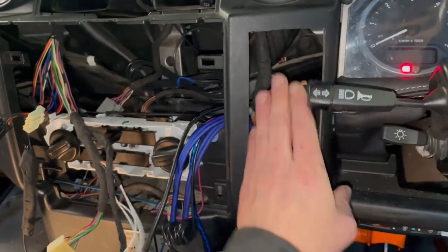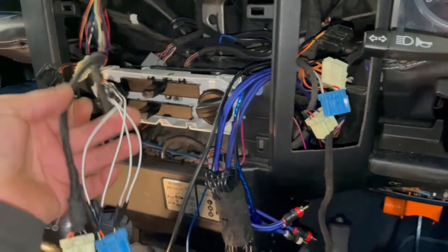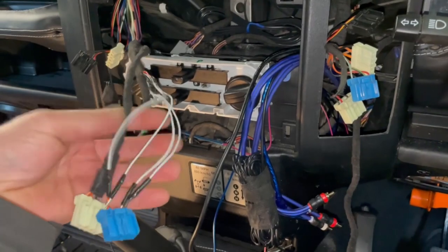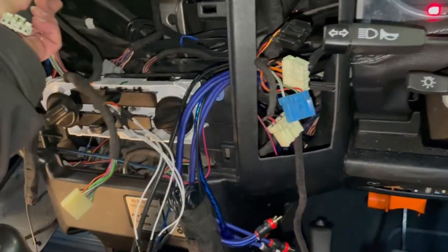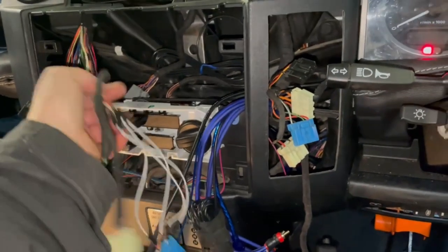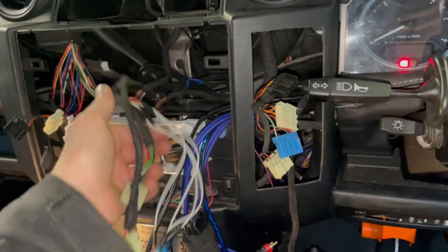Just a quick note - we're going to be extending these cables over here. You'll have to extend them out - I've added solder joins on there and cloth-wrapped them, I've already done that one. This is so you can actually reach across, because otherwise they're stuck very short on that side. So if you're doing it yourself, be prepared to just extend these cables a bit.